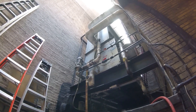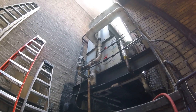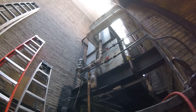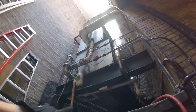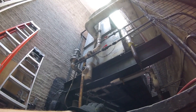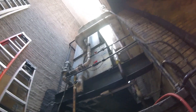Why was the tower dry? Well, there's 100% something wrong. What's going on is the water is not filling up automatically. So I'm going to check the automatic water feed and see if it's operating and if it's sending the signal to the makeup water solenoid to fill up this tower. I'm going to show you guys how that's done.